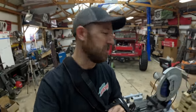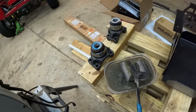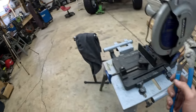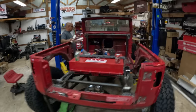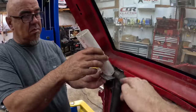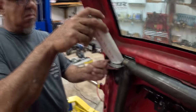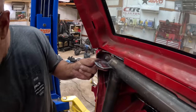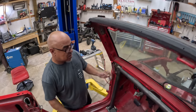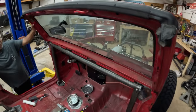One helpful tip: if you're dealing with brackets that are covered in mill scale, all you have to do is dip it in some vinegar, leave it there for a few days, and the mill scale just practically wipes off. So instead of grinding down all the mill scale, get some vinegar, soak it in a bucket. Here's how we're going to bring all these together - we're going to cope and weld into the dash hoop bar our lower bar as well as the A-frame post. The PVC is just for mockup, and then on the bottom we're going to box it all in with some gussets.